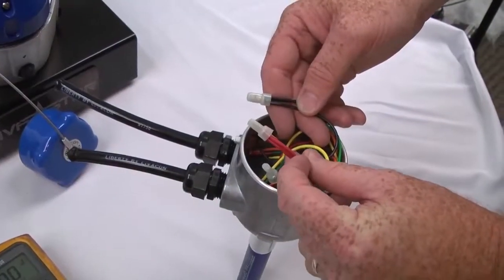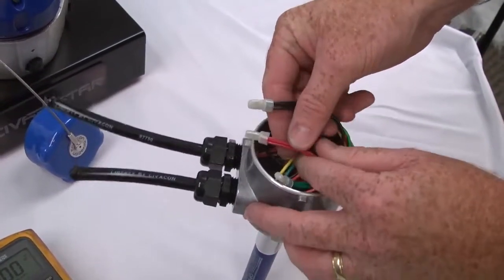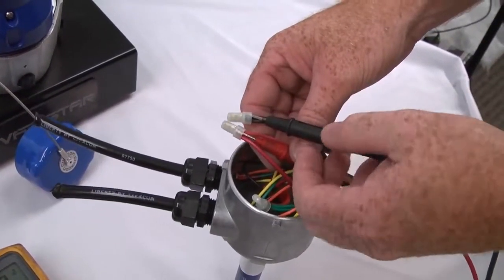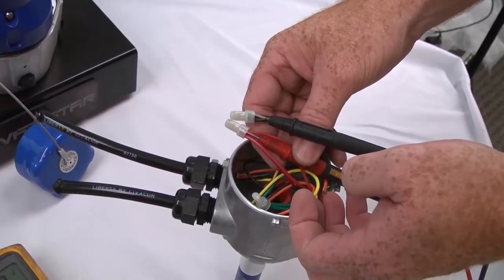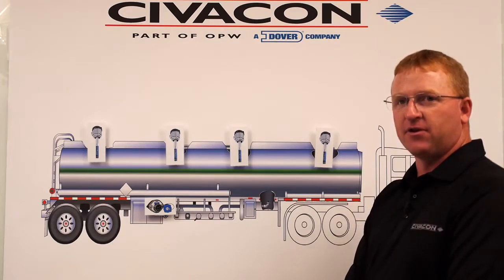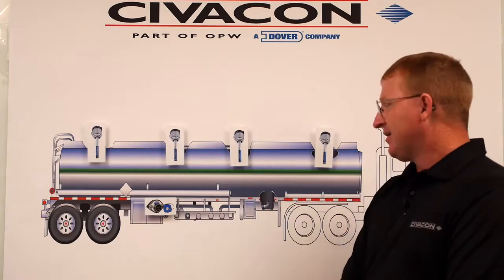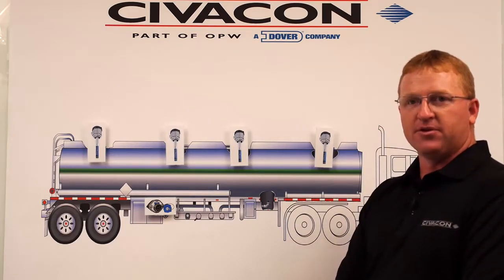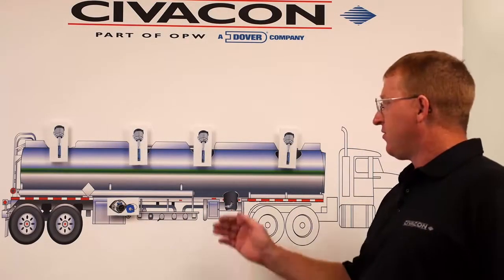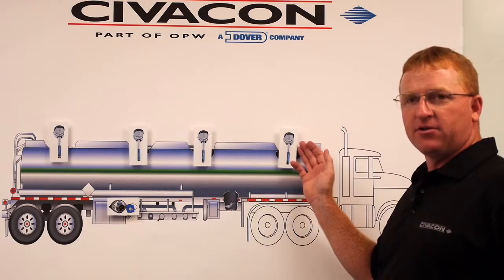If you've verified that all connections are free of corrosion and that the crimps are properly secured, you can check the voltage at the probe that is showing the fault. Simply connect your voltmeter into the red and black wire. The reading should be anywhere between 8 and 24 volts. If you've verified that all crimp connections are secure and free of corrosion and you have the proper voltage at the probe showing the fault, now you would replace it with a new probe to see if that cures the problem. If you've replaced the probe in the number two housing and the problem still persists, rewire the original probe into that housing and move on to number one and install the new probe there.